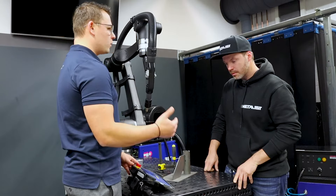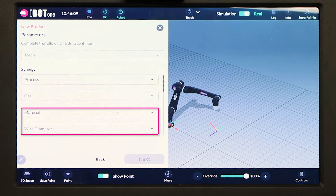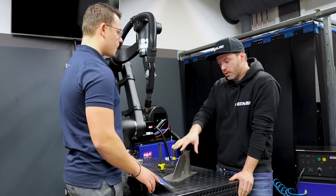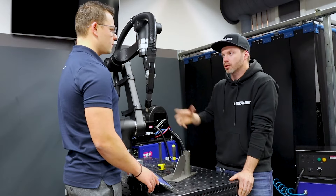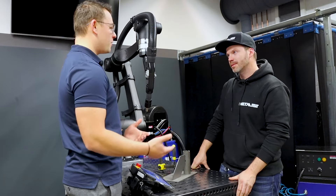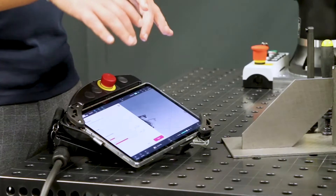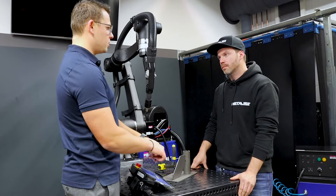On the next topic, we see what the welder actually does in the morning with manual welding. He chooses the parameters: weld process, gas, wire. And he enters the travel speed for the robot — either with a slider or manually — and chooses amps with a slider. The tablet is connected to the welding machine, so you can program everything in the welder, save the file for the next job or your program. There are so many topics ahead, so we decided to release the software now as a zero release and develop with you in the market the best way to proceed.